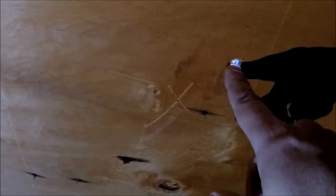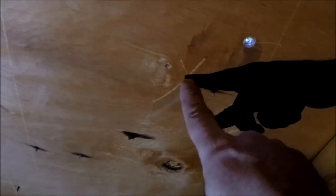Next step is going upwards and I'm going to remark the hole because I had to move things around. I drilled one hole initially, but I'm not confident in the hole. So I've come back up here to shoot the laser again and give it another go. There's the original hole I've drilled and I've just moved it over a little bit — I didn't like the laser, I wound up using an improvised plumb bob. Next thing I do, I'm going to put a screw going upwards so I can find the hole outside.